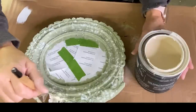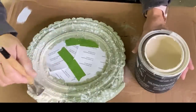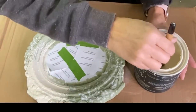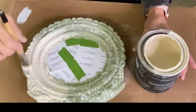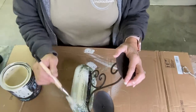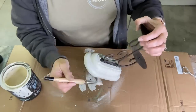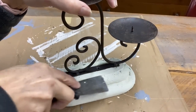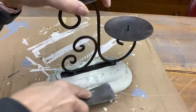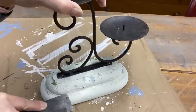After the paint and salt wash has dried, I go over top of everything with the Crinoline. Some of the salt wash is still movable — most of it stays where it is, but some moves around and that's okay; you get a little more texture in your top coat. You want two contrasting colors when you do this technique so you can see the results more easily. Paint the entire surface with the Crinoline and cover everything up. After it dries, take a scraper and scrape the paint — wherever that dry salt wash was, it's going to flake off, giving you this chippy, unique, amazing finish.